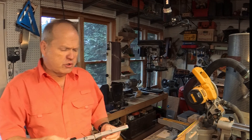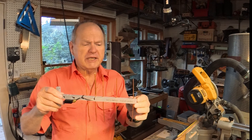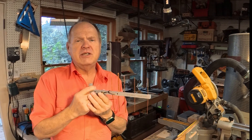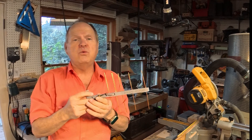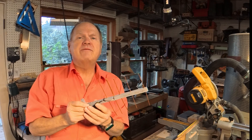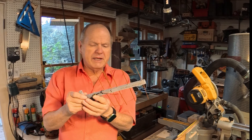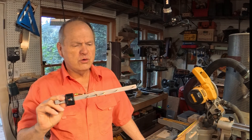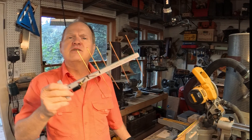In a future video, another type of antenna I can cover is a Yagi antenna — it's highly directional and has a lot of gain. If you're in a situation where you need to point at a particular node that's a significant ways away, trying to reach a repeater, or you have two nodes out in the wilderness that need to point at each other to get more range, then this kind of antenna in combination with the amplifier might be a good choice. Look forward to that in a future video — I'll walk through how you can make one of these antennas for yourself.